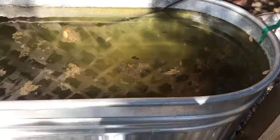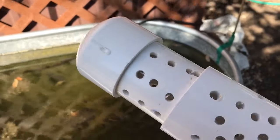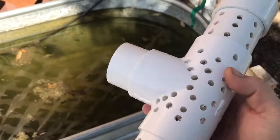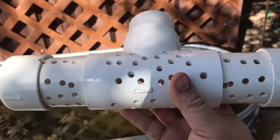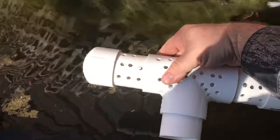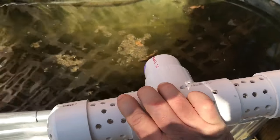We don't want these drains clogging up, so I drilled as many holes as I possibly could without going completely nuts. The two end caps there cover about fifty percent of the surface area each, so that's a hundred percent right there - all the rest is gravy. Also notice that when this sits in the tank, one side faces up and the other faces down toward the bottom. So it's below the surface, away from floating leaves, and even if the top gets clogged you still have the sides and bottom - it takes an awful lot of clogging to shut this down.